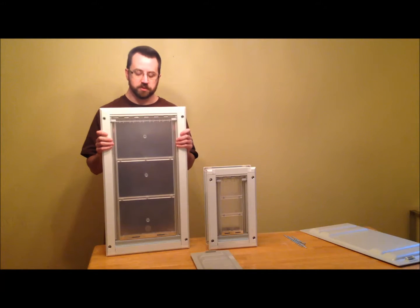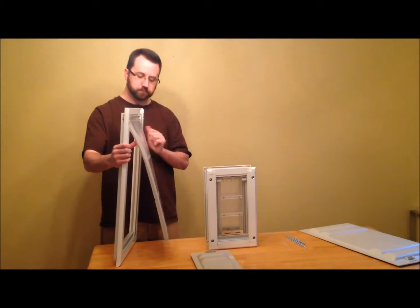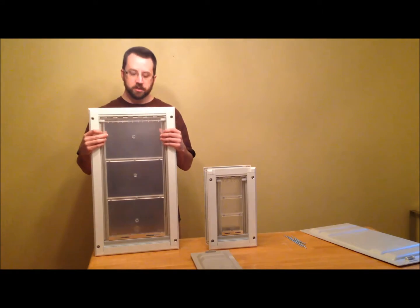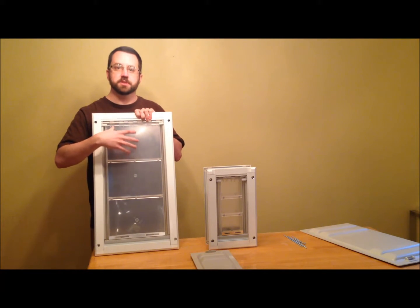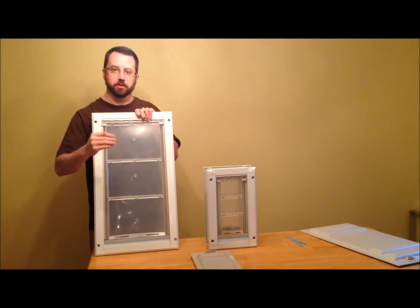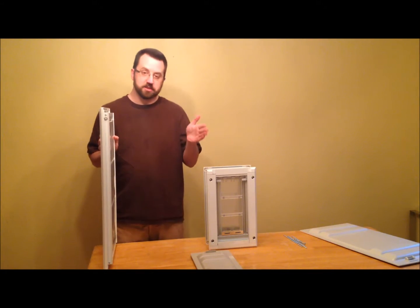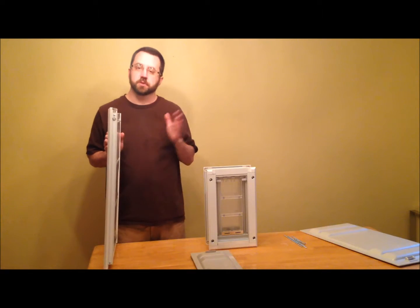They've done an excellent job making this function in extreme cold and extreme heat — what's good for the heat is good for the cold in terms of insulation. The flap is hollow — it's about three quarters of an inch thick but it has an inside part and an outside part with a dead air space in the center. That keeps the flap separated so it doesn't collapse over time and lose the double-pane effect. When you have a frame with a flap on the inside and one on the outside, you basically have two double-pane flaps — four layers from outside air to inside air. Very, very weather tight.